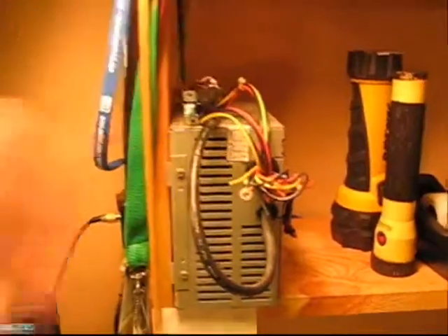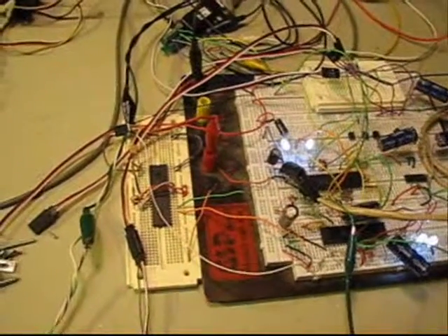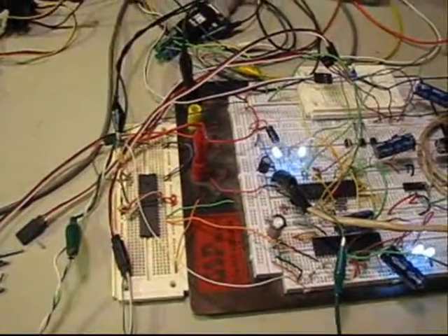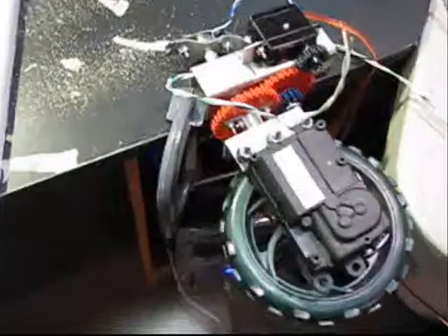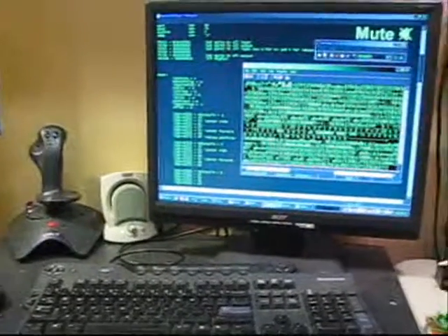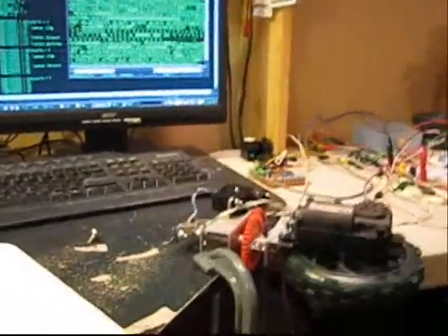Let's go ahead and see what this thing can do. I'll begin by giving it power. I have it wired up to my custom-built and programmed 24-channel servo driver, implemented on a 24 megahertz PIC processor. The entire assembly is connected serially to a HyperTerminal console so we can send various commands.